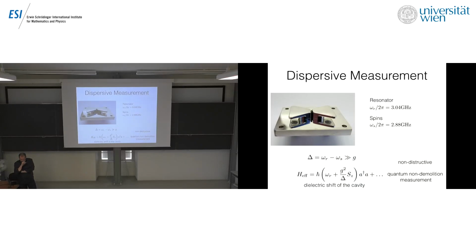Basically, the big advantage of measuring a resonator is, and I made this mistake before: if you have a Lorentzian line curve, I always thought you can only detect it on the scale of the width. But the good thing is, this is such a well-defined curve that you can probe frequency shifts that are way below the line width. You fit a clear Lorentzian and you get an error that's super small. Typically, we have line shifts on the order of kilohertz on a megahertz wide transition.